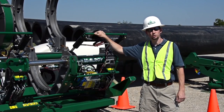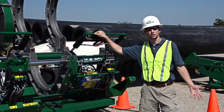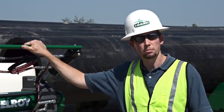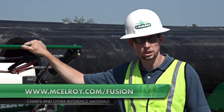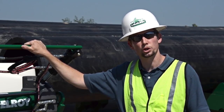As you just saw, fusing large diameter polyethylene pipe with the TrackStar 900 is nearly effortless and goes quickly, especially with the aid of the McElroy MegaMac Polyhorse. Remember, a properly fused joint will be as strong or stronger than the pipe itself, so it is key that you follow the steps outlined in this video to ensure that your fusion is made to standard. Be sure to check out McElroy's many other videos to help with all of your fusion needs. Go to McElroy.com/fusion to find charts and other reference materials that may be helpful on your job site.